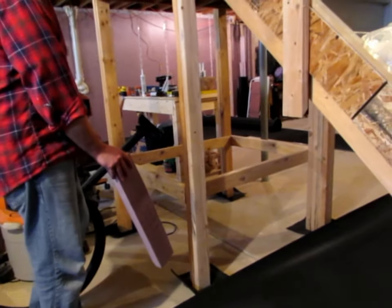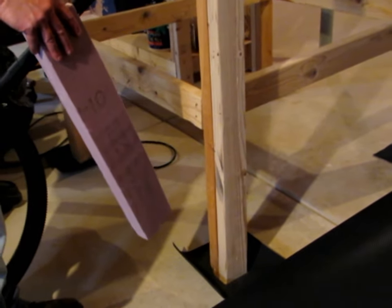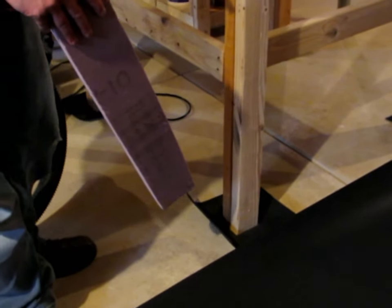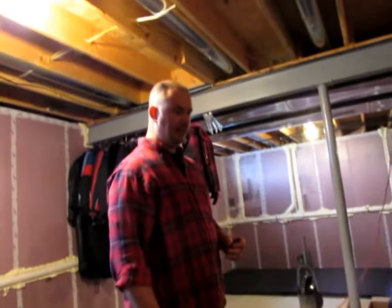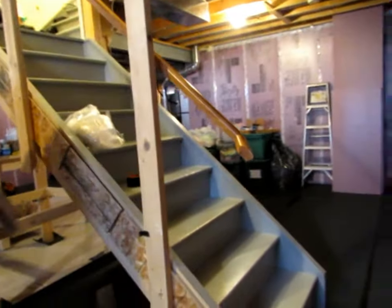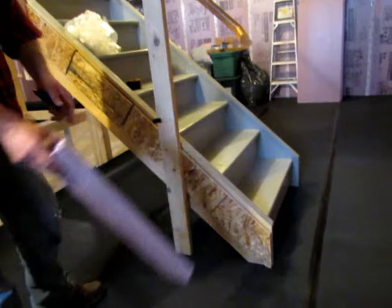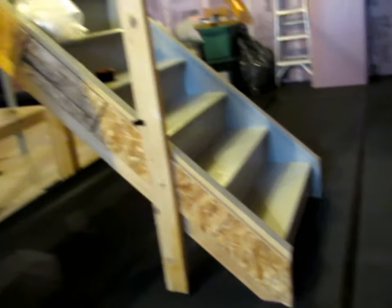In building this, I took some small pieces of the dimple mat and built a support structure on top of the dimple mat. I used a fair amount of force to make sure the dimple mat was actually crushed a little bit into the ground so I don't have any springy effect from that small eighth-of-an-inch dimple — you can actually see over there how well it's crushed into the ground. But it's still going to give me that moisture and vapor break on the ground. Same thing over here on the staircase — I removed any of the other walls and support structure, and I actually just temporarily lifted up the staircase a little bit so I could bring the dimple mat all the way underneath the staircase. Now this staircase has a vapor break from the contact with the concrete.